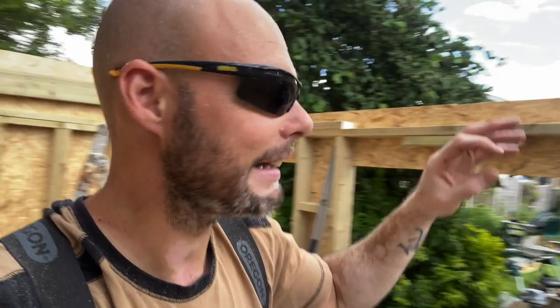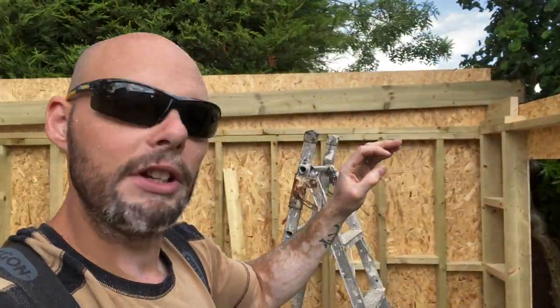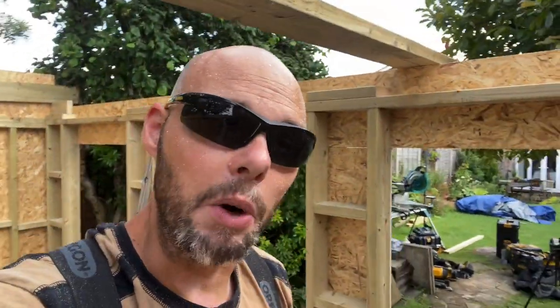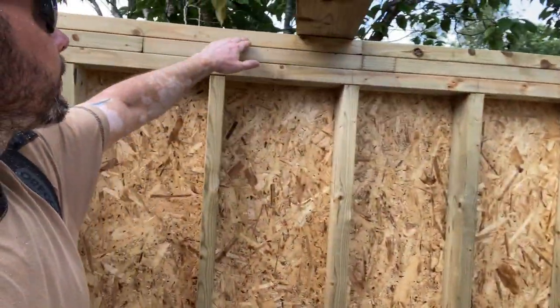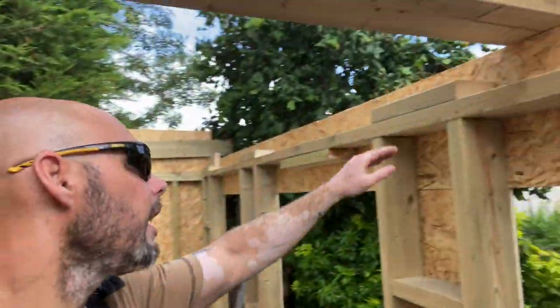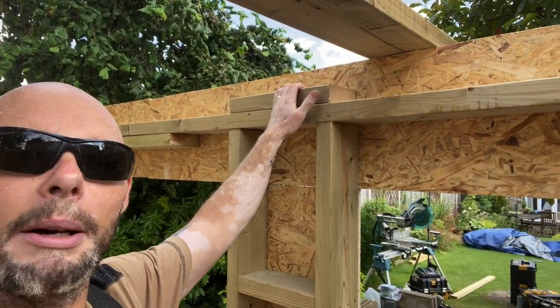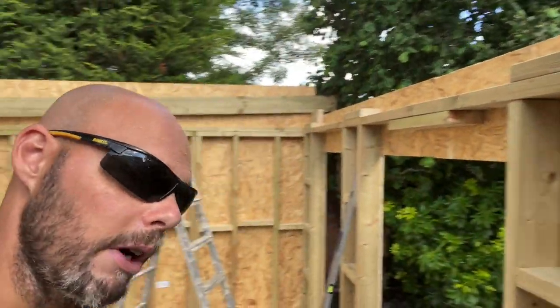So always make it just a little bit shorter, gives you a bit of leeway, because then you can always just pad it up when you need to, and you know you're definitely safe, you're definitely sorted, you're definitely under permitted building regulations then. So that is what I've done. I added an extra trimmer to the back, and raised it a bit at the front, which has basically given this part a double trimmer, a double header, which is beautiful anyway. So that worked out really nice.